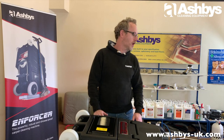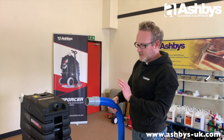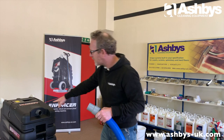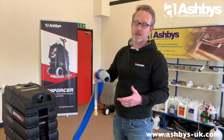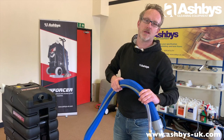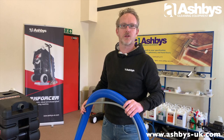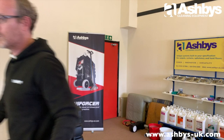Now we connect the hoses. We have two different hose sizes. The vacuum hose is a two-inch diameter hose — it has a two-inch cuff on the machine end to fit the two-inch spigot, and a one-and-a-half-inch cuff on the tool end to connect to the carpet cleaning wand or hand tool. Two-inch hoses are less flexible inside someone's home, so I try to limit how many I run indoors to avoid damaging furniture or catching on banisters and wall corners.